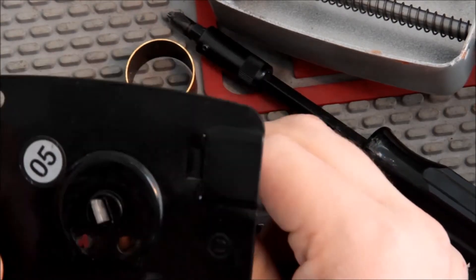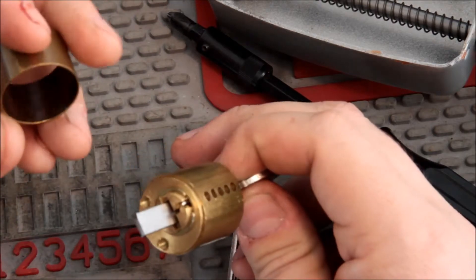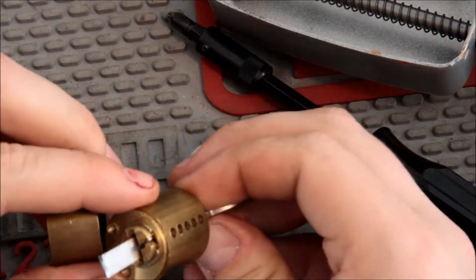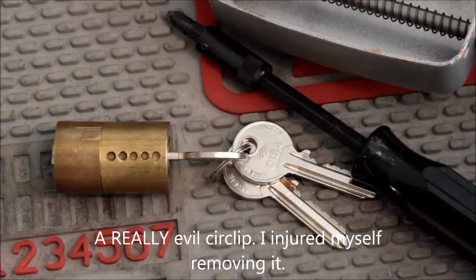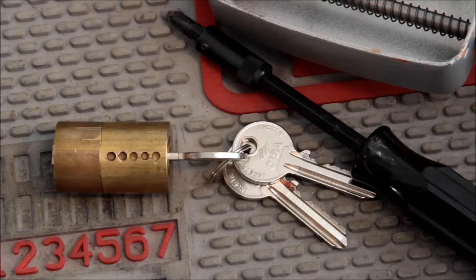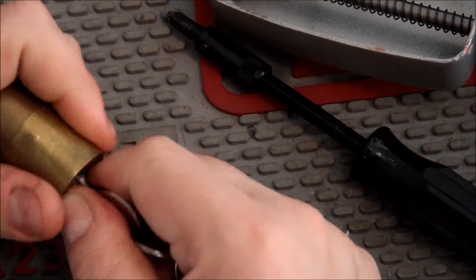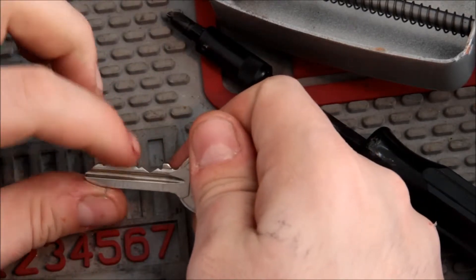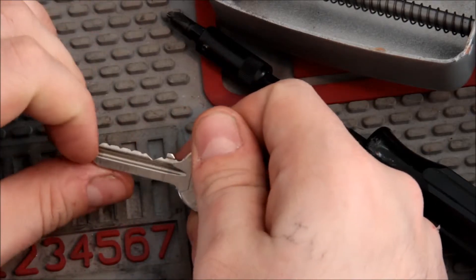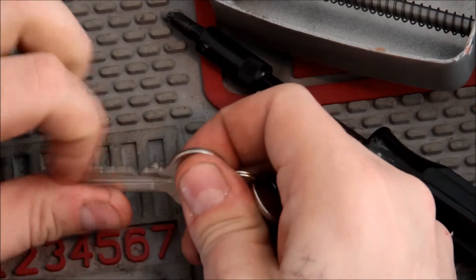I don't know how hard this metal is or what your door is made of, but at least it doesn't have that obvious bypass vulnerability. It's been an evil circlip though. I thought that was kind of cool. I don't know if I'm going to bother gutting it. I did suspect there might be a spool or two in there, but it wasn't too hard to pick — largely because the key bitting, if you look at it, is essentially zero-bitted. Those are all zero cuts, so maybe you're meant to swap out some of these pins.